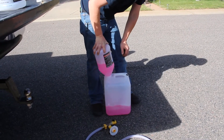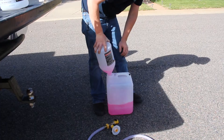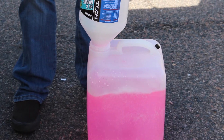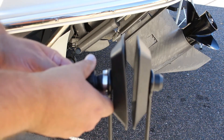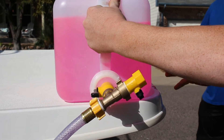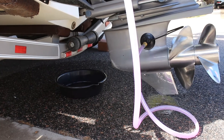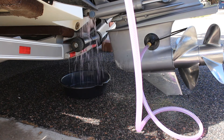I will put a link in the description below to where you can get this boat winterizing kit, so be sure to check that out. First, reattach all of your hoses and reinstall all of your drain plugs. Next, you will fill the jug with marine-grade antifreeze — in this case we filled it with 5 gallons of marine antifreeze for my brother's boat, which also has a Volvo Penta V8 engine. Next, connect one end of the hose to the jug, then connect the other end to your motor flusher, aka boat muffs. Place the boat muffs in the correct place on your out drive. Turn the jug upside down and open the valve so that the antifreeze fills the hose all the way to the muffs. Then start your engine and let it idle until you see the antifreeze coming back out of the out drive, which means your engine is now full of marine antifreeze.